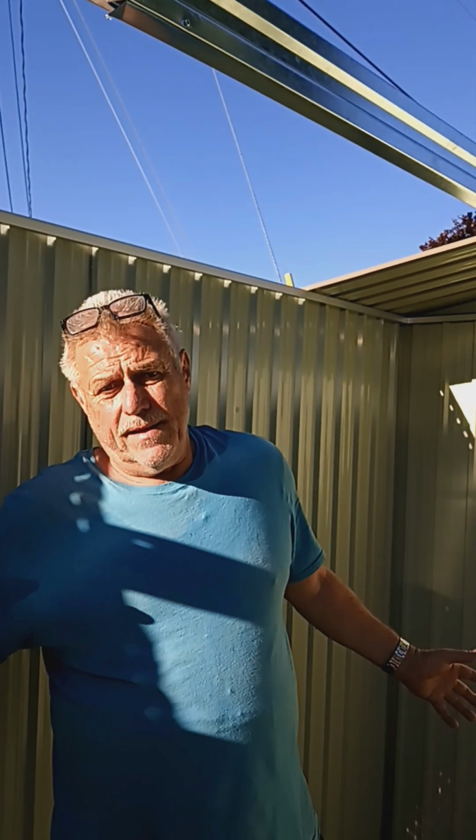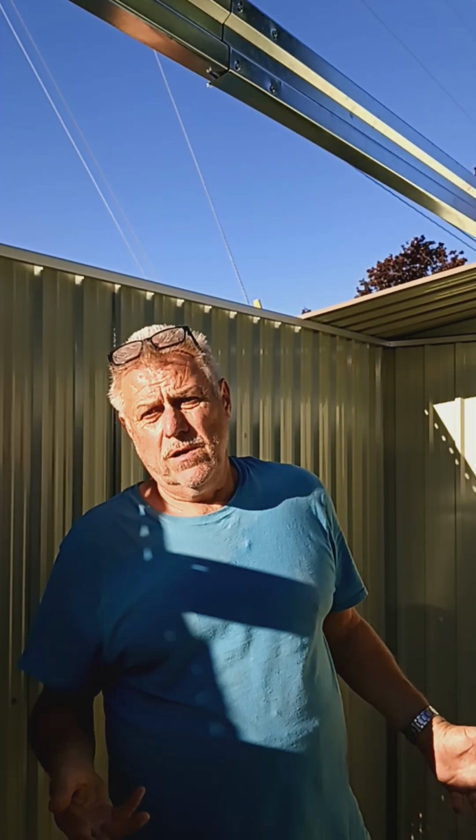And we got this one, it was 10 by 12, but it was actually a little over 12 feet. So you want to make sure you measure your rails before you put up your platform. We have 2 platforms here we made out of wood decking platforms. So we had to actually add on to the end because it was like 12.2 or 12.3. And I think that's because they measure in millimeters, and it doesn't really convert directly over to the inches. So make sure you check that out before you do it.